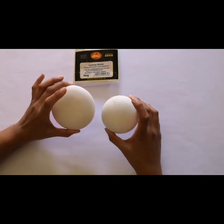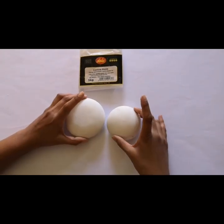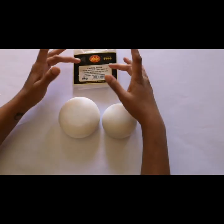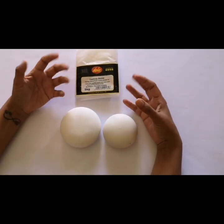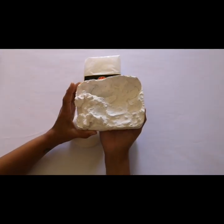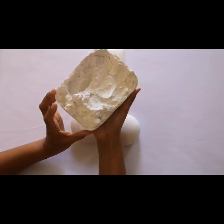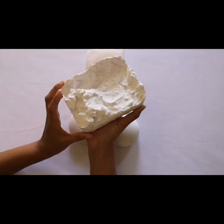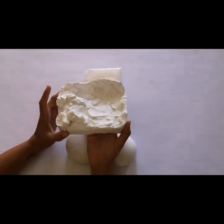These molds started setting in about 15 minutes. What first happened was I mixed according to the plaster and water instructions, but I felt the consistency of the mixture was a little too runny, so I decided to add a little bit more powder. Within seconds it started thickening and I wasn't able to pour it out into my mold — it set in the container I was using, and unfortunately this was wasted.